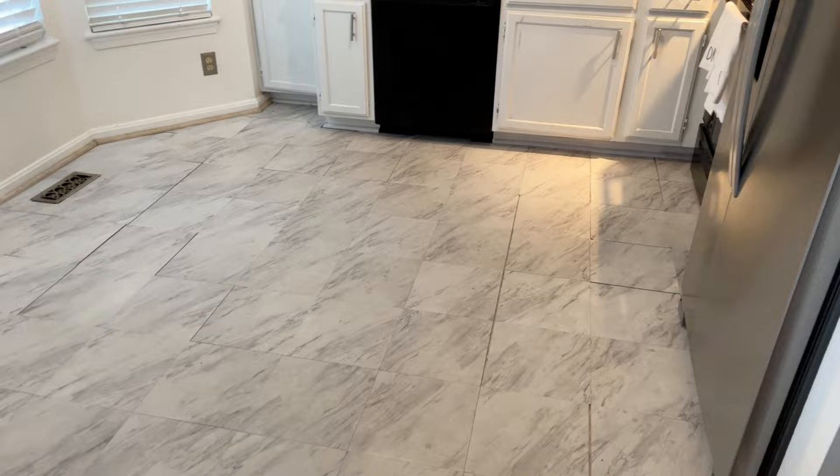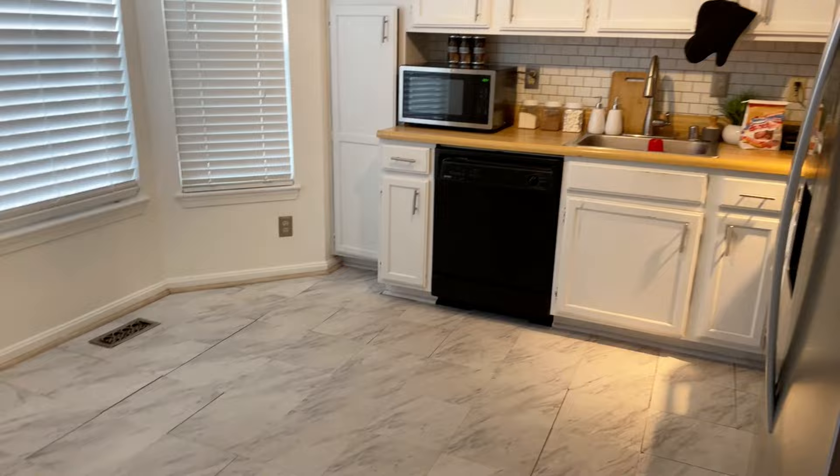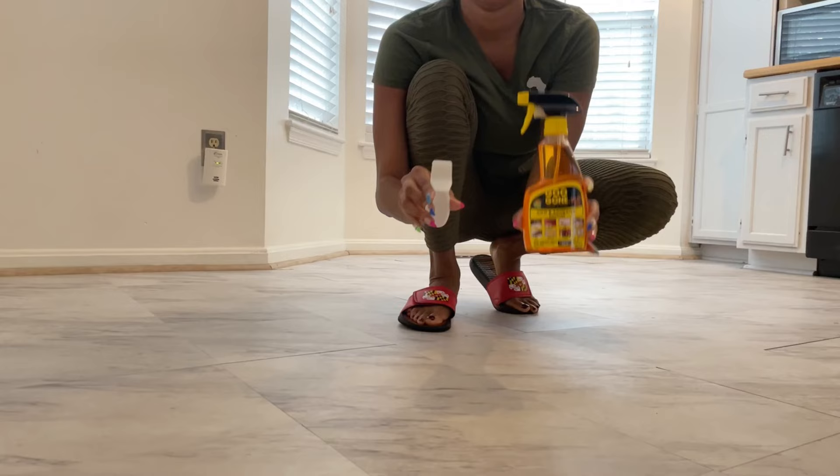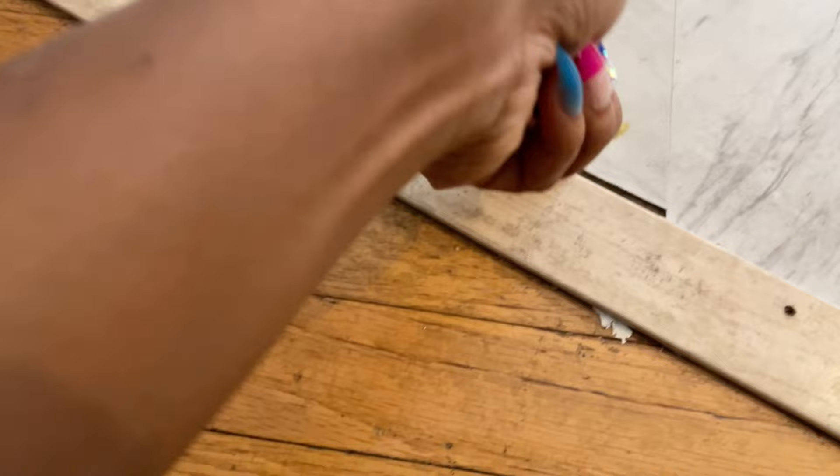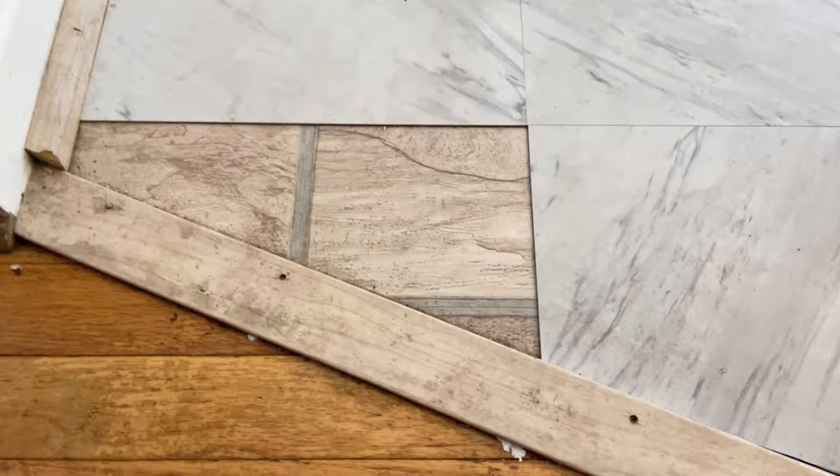It's time to remove these and that's what I'm going to walk you guys through today — we're going to say bye and get to moving these off. To remove your peel-and-stick floors, you're going to need Goo Gone and a little spatula. I ordered this from Amazon; it came with two bottles of Goo Gone and this little plastic spatula. If you have something made of a stronger material, that would probably be better, because this one broke down and I can't use it again after this process.